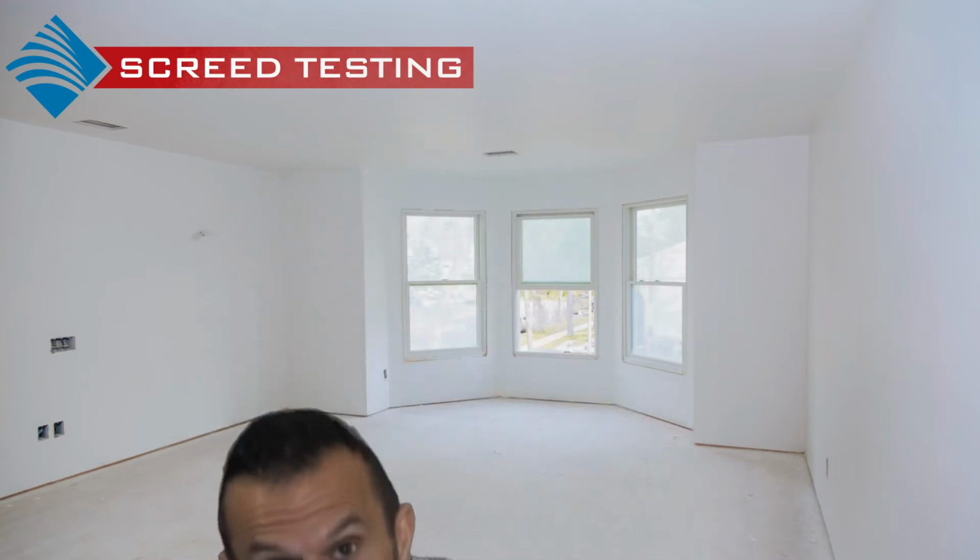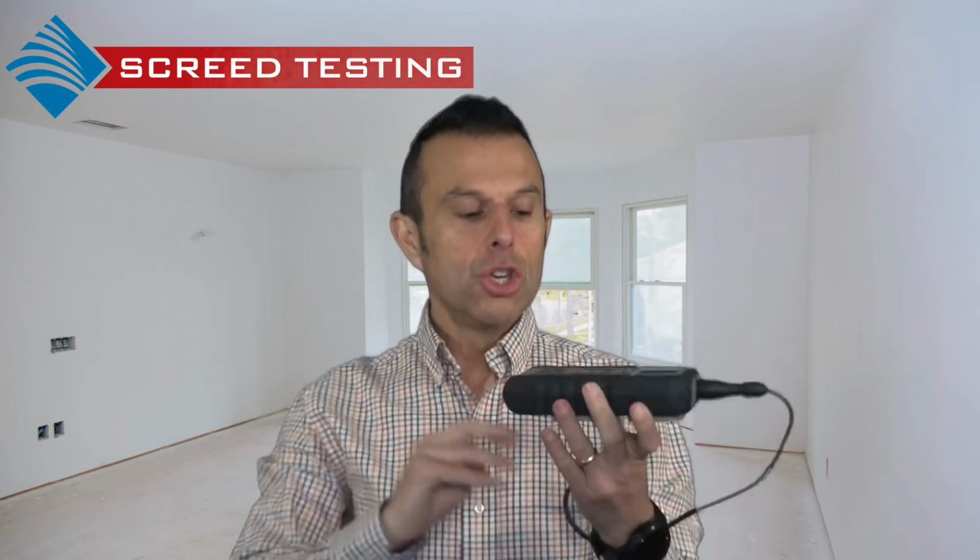A non-destructive moisture test can be carried out using the CMEX5 meter, measuring quantitative moisture content percentage. The CMEX5 also provides carbide bomb method equivalent.